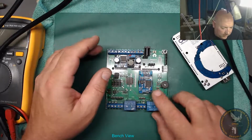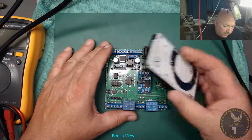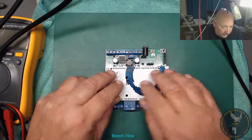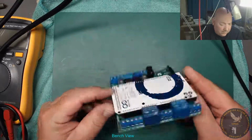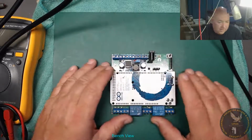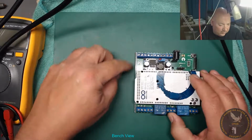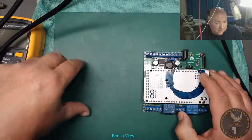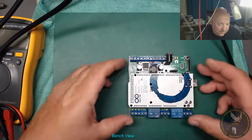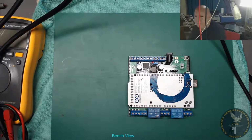Okay, so that's the PCB. I call that the bottom or the main PCB. The controller sits on top of there, which is an Arduino Mega. I've also, as I've told you before, got battery access for the battery backup. Initially it was going to be expandable with these two headers sideways on, which it still is, but in order to keep it compact, I've gone upwards instead. Various reasons for that.